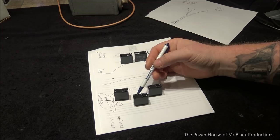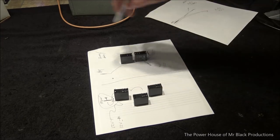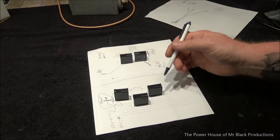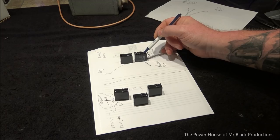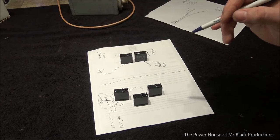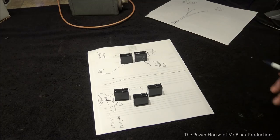We're going to capitalize on the time delay. So you're going to have our primary relay that's going to switch all this other mess. The last thing that we want to have set off in both chains is going to be the transmit, and then taking our relay to control from the 955, allowing that to switch to the antenna. Got it? It's really simple. No, it really is. It's five relays, and we're doing this all in a sequence of events.